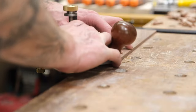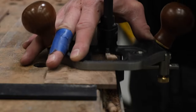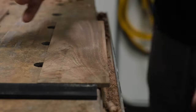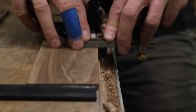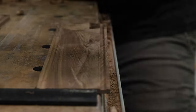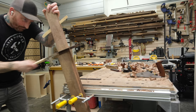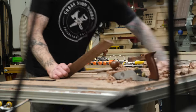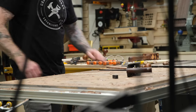I have to cut dados in the side pieces for my box. For this I'm using a router plane. It has an adjustable fence, so I'm able to make consistent straight cuts down the grain. This tool is a little tricky to use — I found that if I set the blade even a tiny amount too deep, it tears the wood and can cause splinters. But once I got the blade set to the correct depth, the cuts were perfect. I also realized I was a piece short, which is the downside of not planning or measuring, so I had to cut and square up another piece of wood quickly.